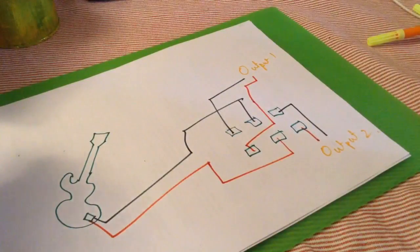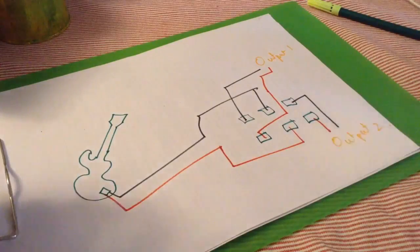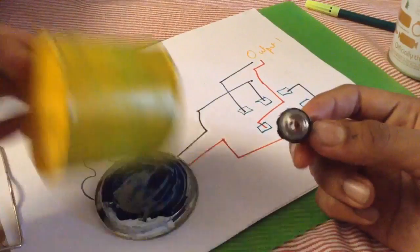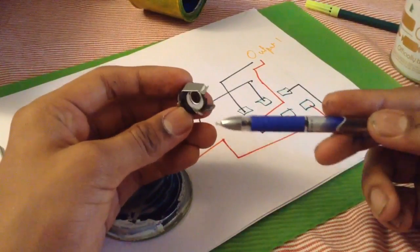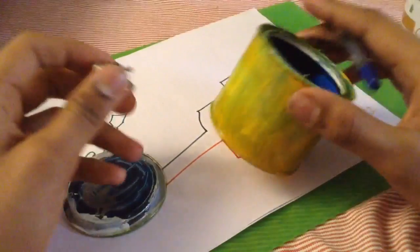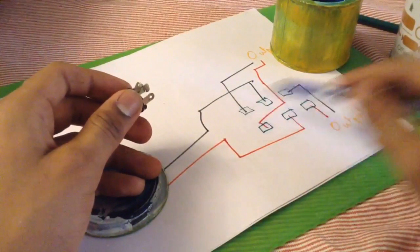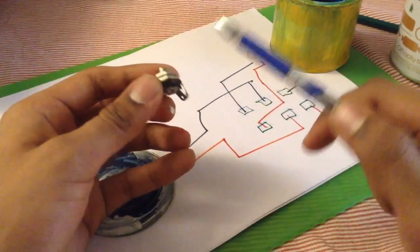This is the simplest diagram I can make. The setup will work perfectly fine if you're making this in a plastic or non-conductive container. But in my project, I plan to use a tin can — this one to be precise. The whole thing is a conductor. Each of these mono sockets has the top end as a conducting end, which is also one of the terminals — this terminal is actually connected to the whole body of the mono socket. So if you want to use a metal container, you can leave the whole ground wiring part out. You don't need that part at all. You just need to make sure the red wire goes to the terminal not connected to the body.